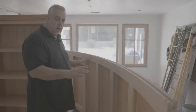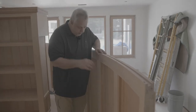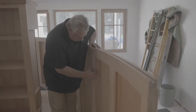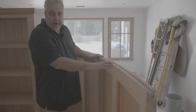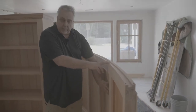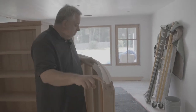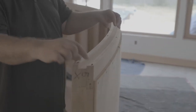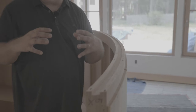We have that panel here. The guys are getting it ready. I just wanted to run through the panel and talk about what they did at the shop. You can see they put it together — we're going to go through the shop drawings again later. We have that nice contemporary reveal in there. This is all vertical grain doug fir. It has a bendable plywood panel here. You can see on the top we have a bunch of holes that are registered to the next piece, so we have wooden dominoes that go in there to interlock the five pieces together to make up the whole ceiling.